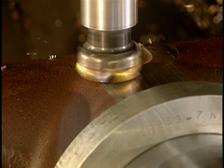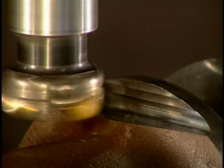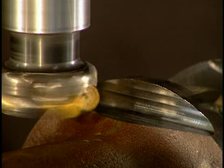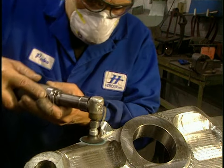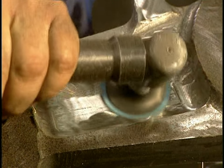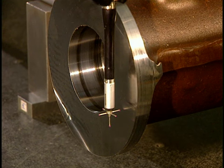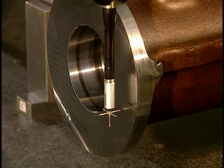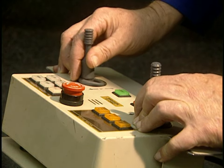Here three pieces are rough cut at the same time by this machine. Because they'll be used in aviation, these pieces have to be machined to perfection. The machining of the shaft is now almost completed. This deburring unit polishes the machine surfaces with a compressed air tool and sandpaper discs. They now have to verify the dimensions of the parts; this digitally controlled machine has three axes and does the verification with extreme precision.